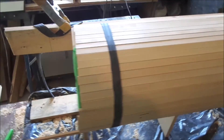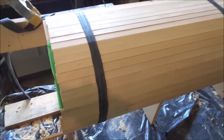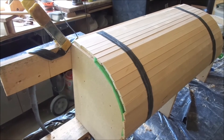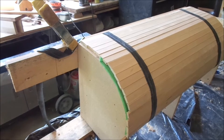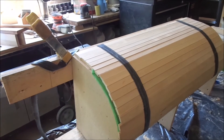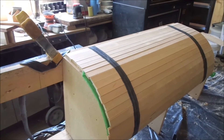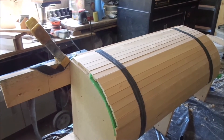For the corner walls I've laminated together wood strips using bass wood to give a nice white color, which will create curved sides at all four corners. I've got this laminated up now. The next step is to sand it, fill all the cracks with epoxy resin filler, glass it, flip it over, sand the other side, and then just epoxy that side — I won't put glass on the other side.